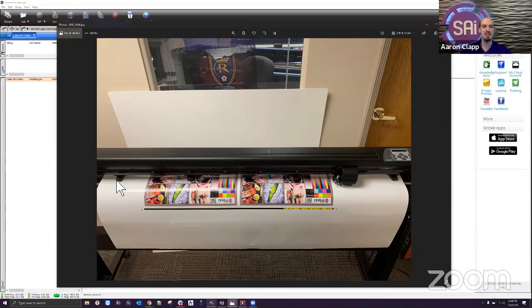Make sure that your clamps are down. Make sure that your pinch rollers on the right and the left, you got enough space. Make sure you have enough space at the back. And then set the origin. So you get the machine ready and then just click on that little barcode button. It's gonna say, place the machine underneath the barcode. Use the arrows, scoot yourself right underneath here. Get that thing close, hit okay, hit enter a couple times, and then it's gonna start reading that barcode. It's gonna fly across back and forth a couple times, read the barcode, and it's gonna stop right here in this corner, wait for production manager to respond with a job, and once it has, boom, it's gonna go.